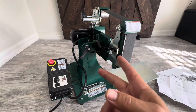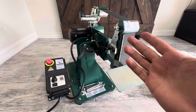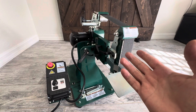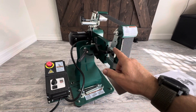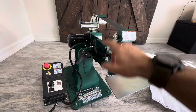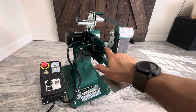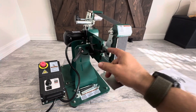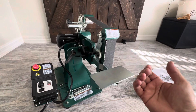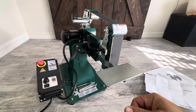Couple of downsides — that's why I say it's a project. But for basic sharpening and several other things, it could work perfectly fine just out of the box. First, this is made for 2x42 belts. But all it takes is swapping this single bar that holds the flat platen. If you change it to the longer bar and move the platen forward to the right distance, it becomes 2x72. That's number one.